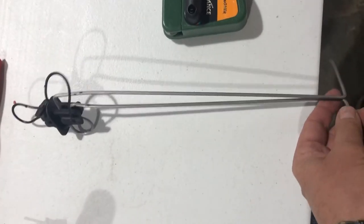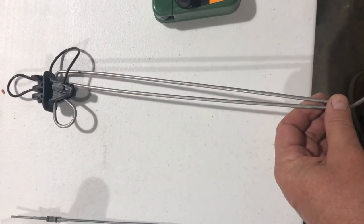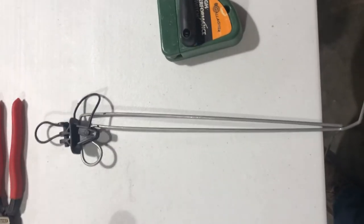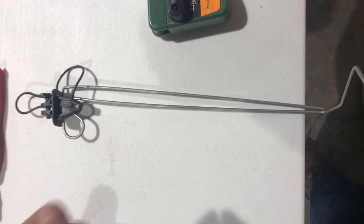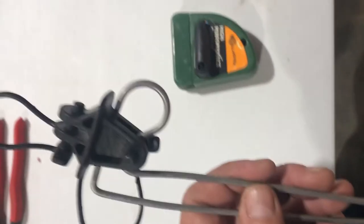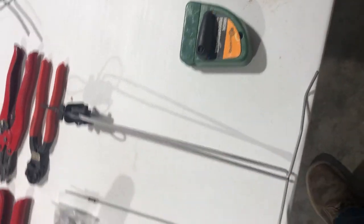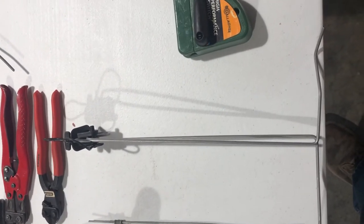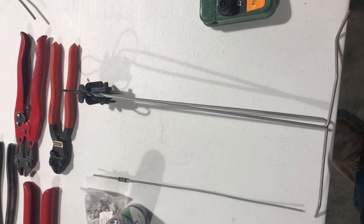This piece right here is a real handy piece — this is an offset. It goes on a barbed wire fence and keeps your electric fence about 12 inches away from the barbed wire. It works really, really good. It does have a pin lock in it, so this is a really nice thing. I use it in several places, mostly when I'm trying to get back to where I really want to put the wire, but if you want to keep cattle from pushing even on a barbed wire fence, this works really well.